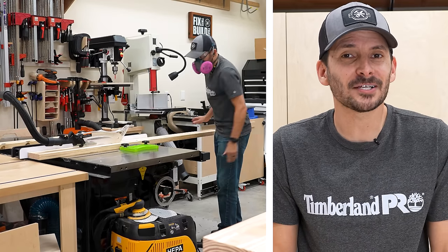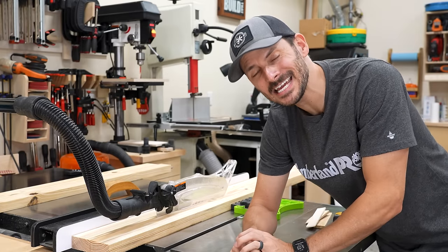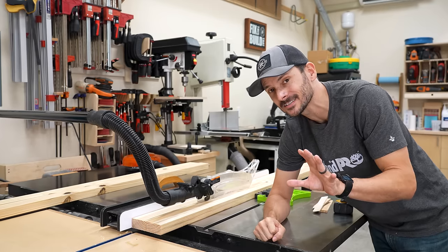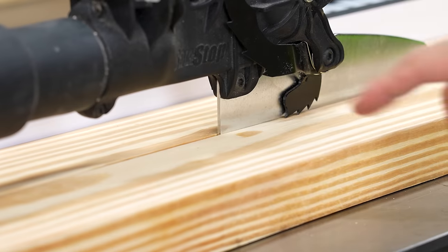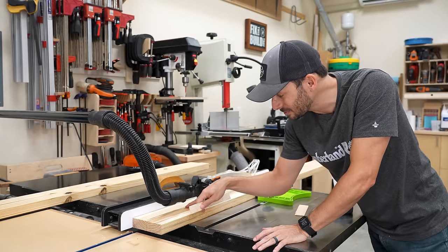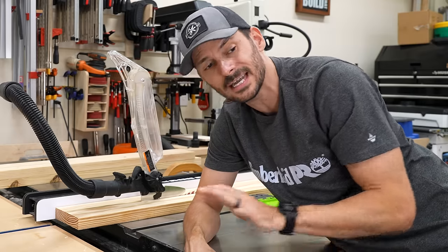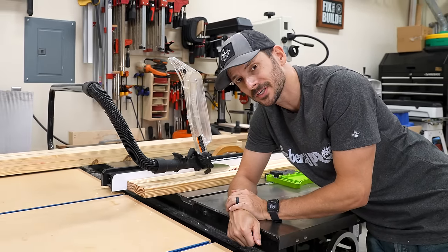Although they may just have some surprises waiting for you inside. I was about a third of the way through my second cut and it started bogging down on me — and that takes a lot because this is a five horsepower table saw. If I look at the back, I can see that the board is pinching the riving knife. So I'm going to put some shims in between the wood to try to open up that gap so it's not closing down on the blade. Hopefully I will not have to do this on every single board — but yeah, the joys of working with construction lumber.